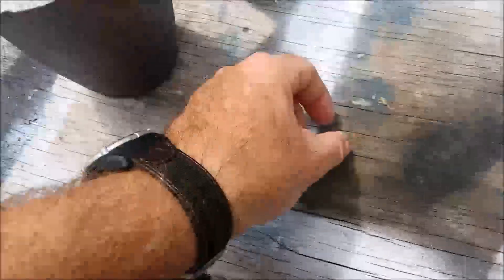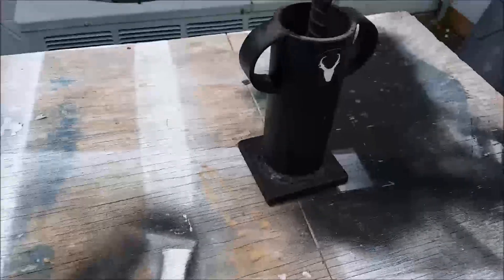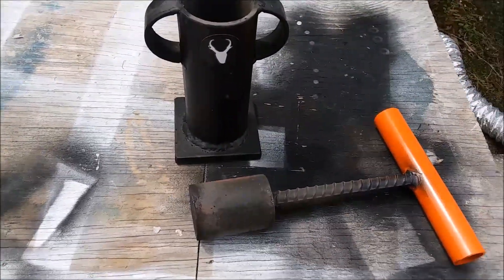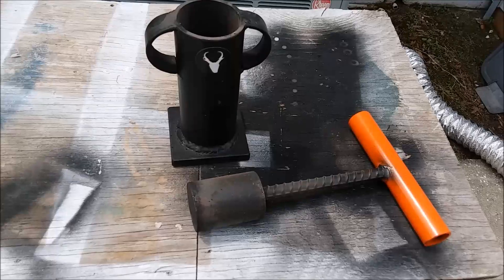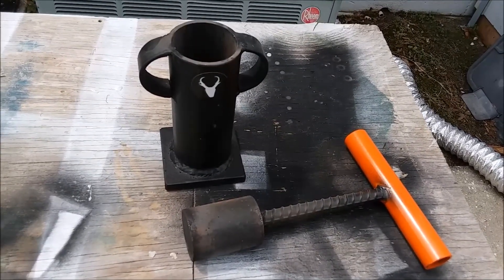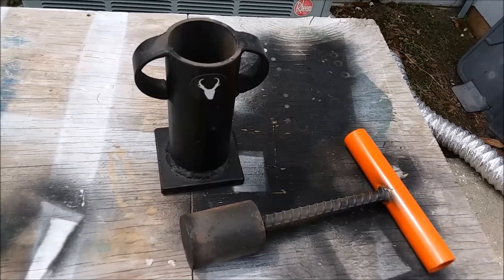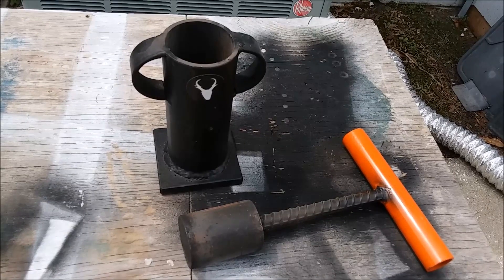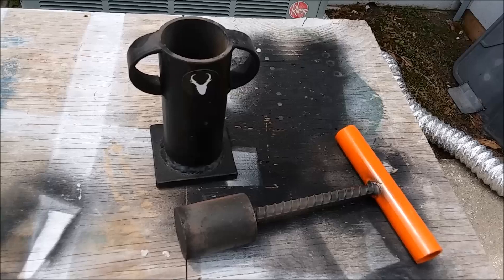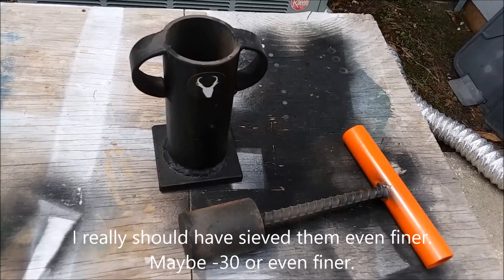So I'll put that back in there. What I'm going to do is crush them up in my ore crusher — just a little hand ore crusher. I would highly recommend if you crush up these chips that you wear some breathing protection, because it produces a lot of really nasty dust. So I'll commence to crushing. I'll run them through probably a 10-to-the-inch sieve, and anything bigger than that will go back through the crusher again.